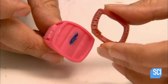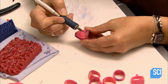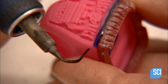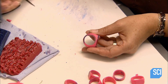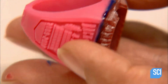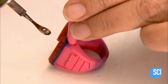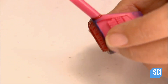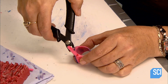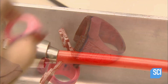The next step is to assemble the wax models of the ring's components, connecting the parts with joining wax applied using a fine-tip soldering iron. It's at this stage that they also size the ring for the customer — either cutting out a section of the shank to downsize or adding to the shank to enlarge. Next, they begin building a wax structure on which to mount the wax models for several rings they'll be casting simultaneously. They solder a small stem to each model, then connect each stem to a large wax rod.